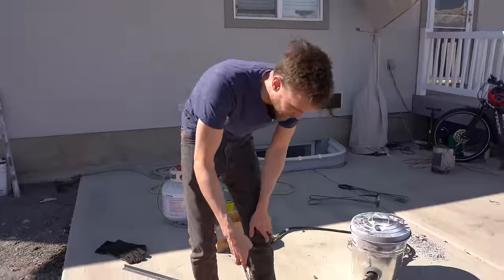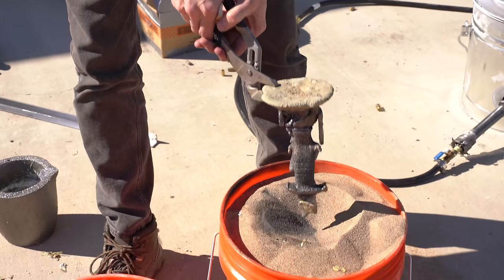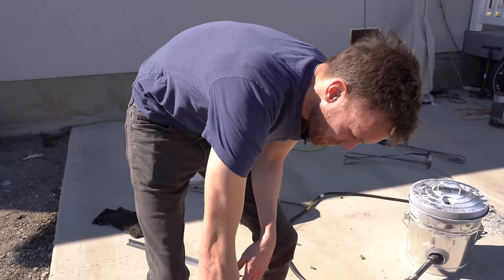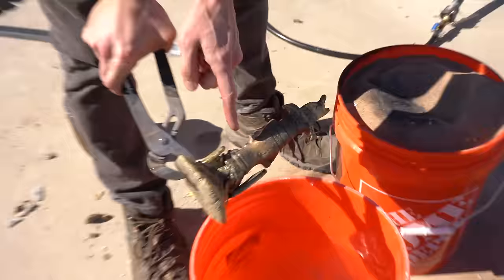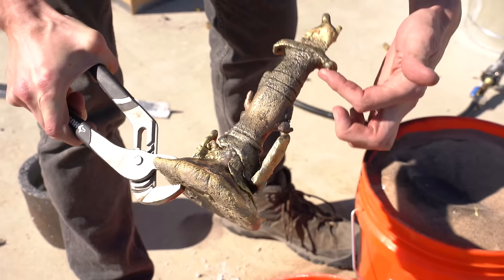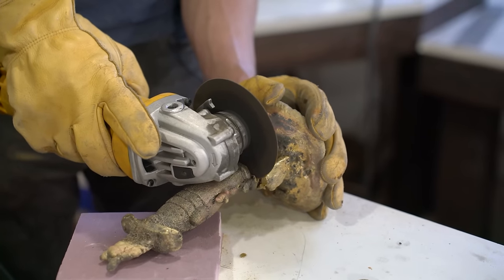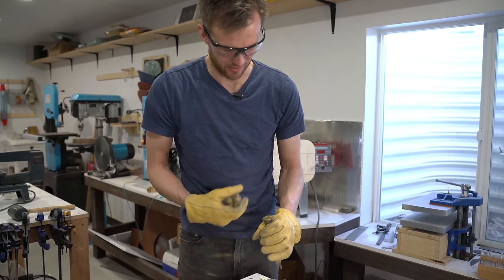So let's find out if we have any knife at all. Well, we got a decent amount of pour, but the blade was a little too thin. Maybe cutting that blade down to less than a quarter of an inch thick was not the best plan for a sand casting. We can definitely see what poured in — a couple of spots where it just broke out and left the sand mold. We got some of the guard, some of our channels that were supposed to fill to the guard. You know what though? I think I can still make this work. I was worried the brass was going to be full of holes and a low quality pour, but this is looking really nice and solid, so that is very encouraging.